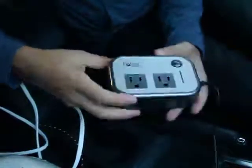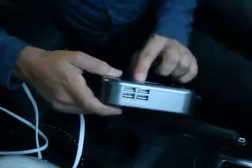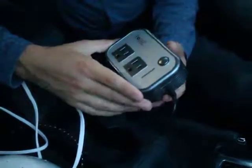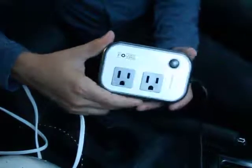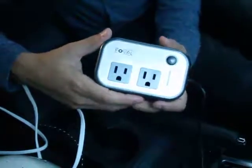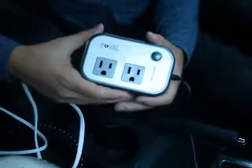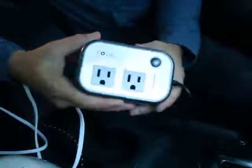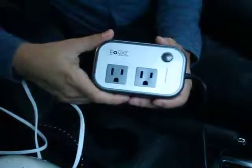So there you go. You get the full 120 volts, 110 volts out of there, 200 watts. It's good if you read your devices and see what they really add up to. A lot of DC stuff, your cell phone charger or something like that, is really barely anything. It's usually a couple of watts, under 10 watts. Obviously you could use a 30 watt light bulb as a standard and then take it down from there. An LED light bulb is using less than 10 watts. All sorts of low power devices, you can theoretically power a whole bunch of these at once.